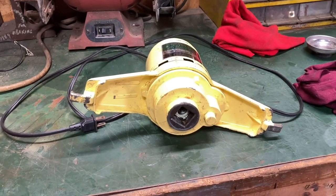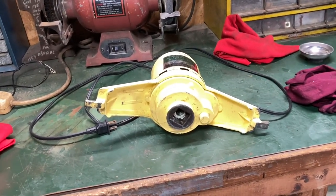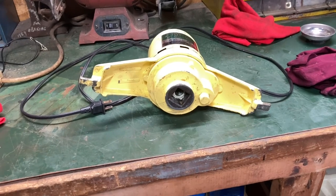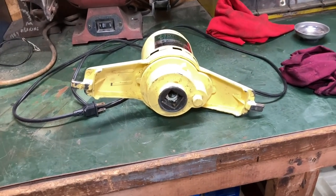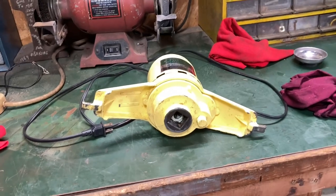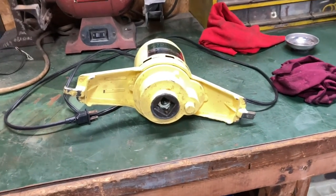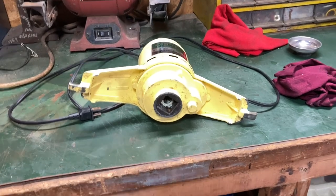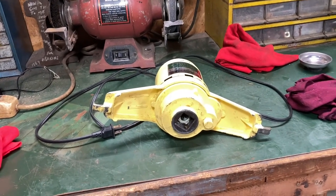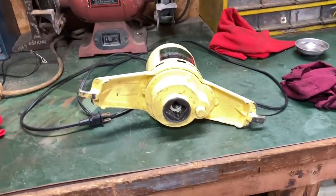Just the old guy's idea here in this video — how I repaired my other one by making a homemade bushing, and we're going to see how that fares out. The other one I took apart and did some maintenance on it. I have some wear on the main drive gear, but right now I'm going to take a chance on it. As long as I keep an eye on it, the worst it can be is I just have to buy another gear — but I've got to make sure the shaft is right because the two motors do have two different sized shafts on those gears. Just wanted to make this video — maybe it'll help some of you folks that have White Mountain ice cream freezers and can't get pieces or can't afford to buy pieces. They can be fixed.